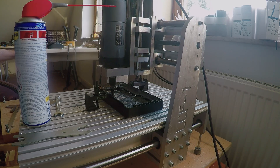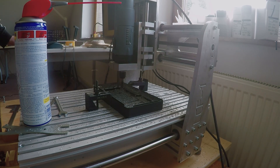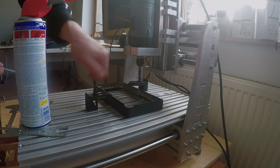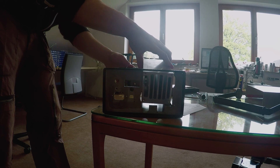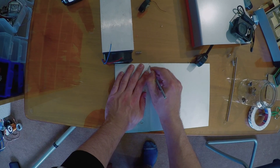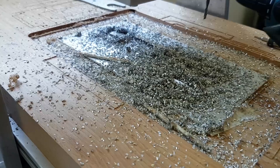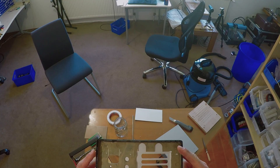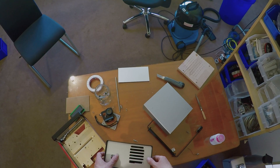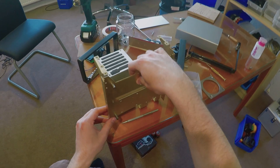I've got to mill out the original front and back plates, because they were accommodating the thermal vision controls. I'll make new front and back plates with only the cutouts that I really need. I'll reuse this base plate, because it gives a lot of rigidity to the enclosure.